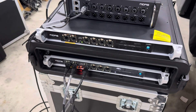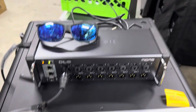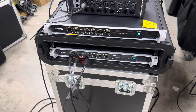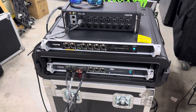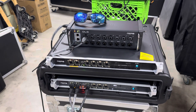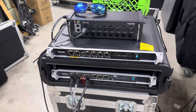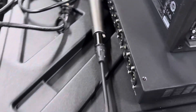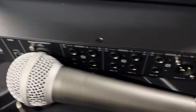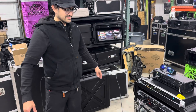He mentioned he might be able to put in a request to have control of routing out of this port into our traditional blue boxes to get the last couple of inputs through that. Pretty cool — these stage boxes can go wherever we want as mini stage snake drops with inputs, outputs, and PoE power. On the back of both the Hub 4 Pro and the regular Hub 4 you also have stage connect outputs you can utilize.